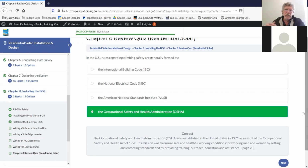And that's why when you design a racking system, they'll ask you for the zip code in these online tools, because then they estimate the anticipated wind load and the anticipated snow load of that particular jurisdiction, that zip code, and it'll factor it into the design of the rack.